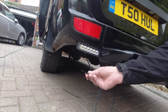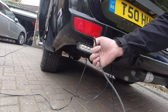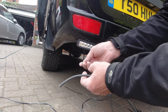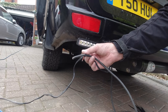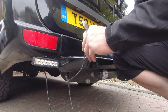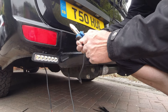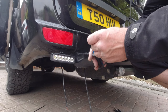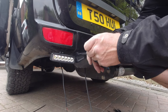So this will just give you an indication of how they work. What I've got here is the cable that comes out of the light, which is two-core. This is the cable I've soldered to the same light on the other side, also two-core. And then this is the thick cable, also two-core, that runs the full length of the chassis. What I'm going to do now is tin all these wires — which basically means putting solder onto all the ends — then join all three together and shrink wrap them to make a watertight seal. I'm a bit old school; I basically do it the old-fashioned way with just a pair of snips, and when you've done it as many times as I have, it becomes second nature.